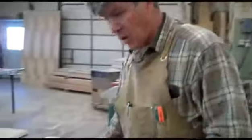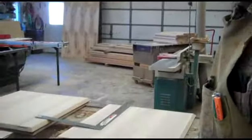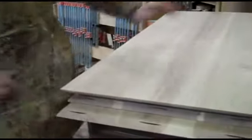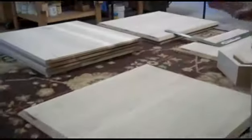These are the carcass pieces for the cabinet itself. This is an end that will be vertical, so it has 45-degree angles on it, and it will attach to a longer horizontal top and bottom — just a box except that one end has an angle. So these little lamello splines are going to help me with the assembly initially. Once it's all glued, it's not very strong yet — a miter is a very weak joint.